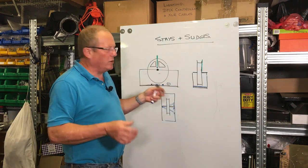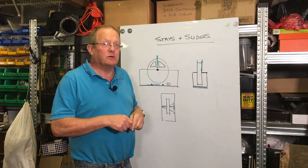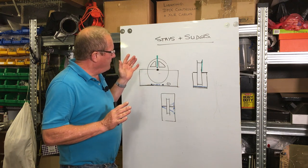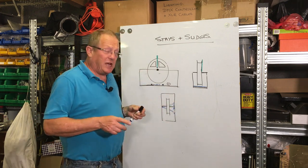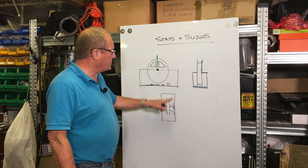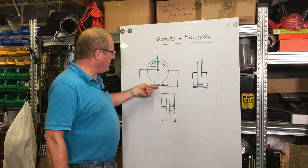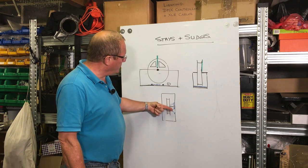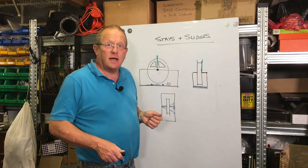If it was just for me and my wife, then I probably wouldn't bother. But I want people to understand what it means to stand a bell, and also what it means when a stay breaks. I've come up with a potential plan, which is to fit a slider onto the bottom of the frame, which you can see in plan view, that is pivoted on the steel channel on one side and will move between two blocks that we bolt down in the channel, as a normal slider would.